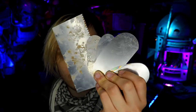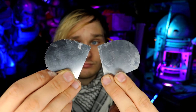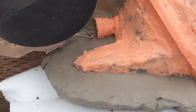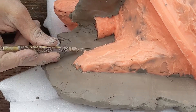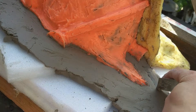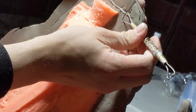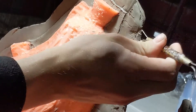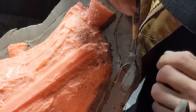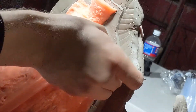You can buy a whole variety of different types of scrapers. I personally like to buy doubles — that way I can cut some in half. When I have these half-cut kidneys, it's easier for me to work in tight areas. Around this point is a good time to make sure that my clay is butted up against my silicone mold. Then I like to take the edge of one of my scrapers and scrape in a registration key line along the sculpture. Depending on how tight a space you're working with, sometimes it's beneficial to carve it out with a clay wire tool first, before you go over it with a rake.